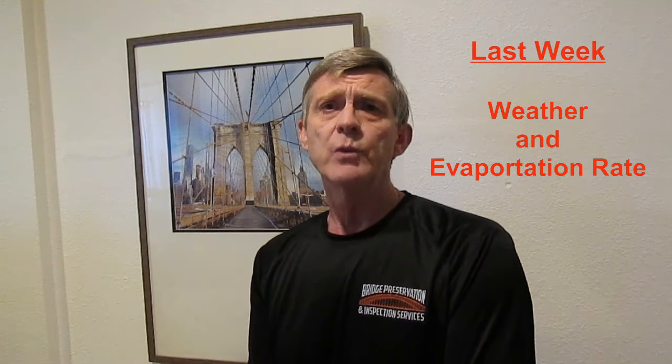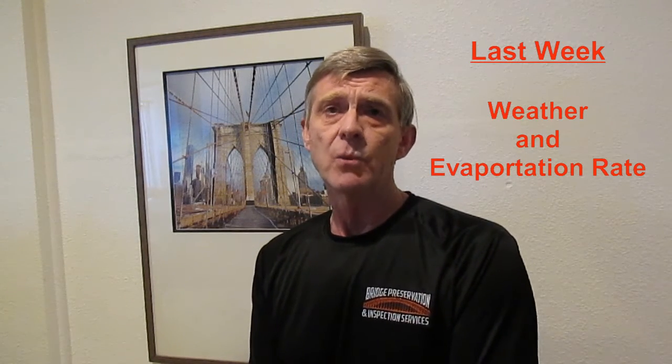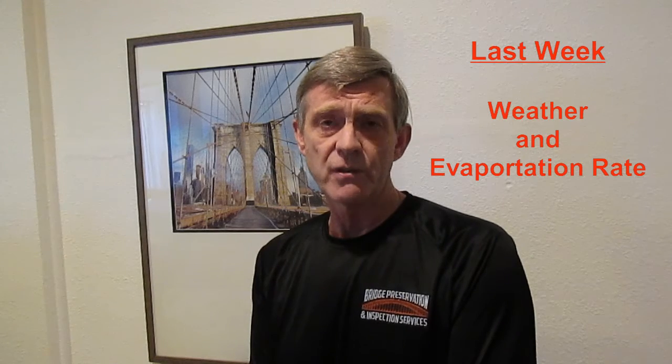We're continuing with our current video series on pre-pour considerations for HPLMC overlays. Last week we talked extensively about the importance of the weather and evaporation rate. Today we'll address the finishing machine setup and considerations during the pour with regard to consolidating and finishing the concrete.